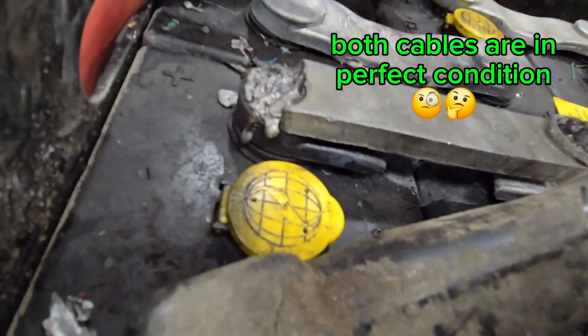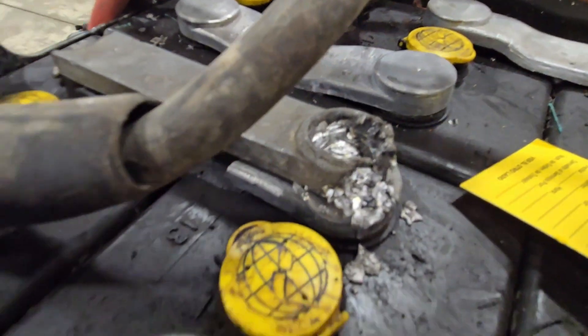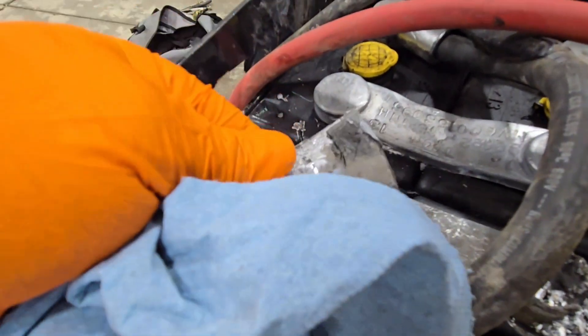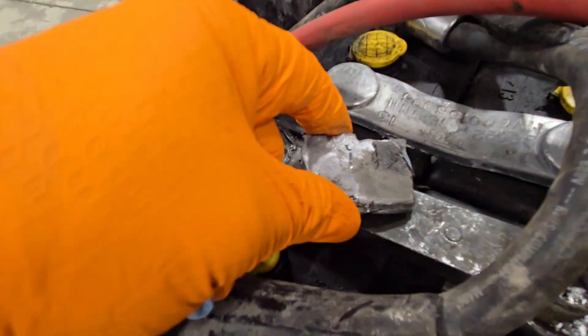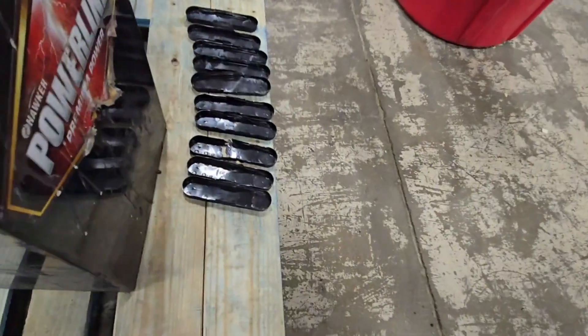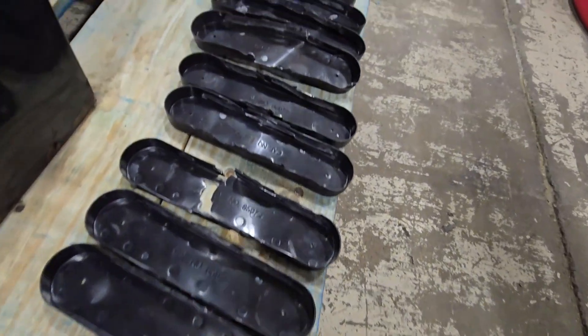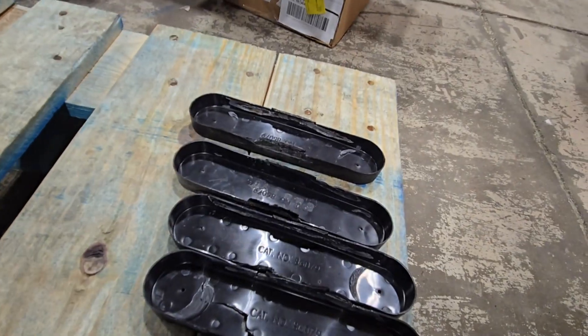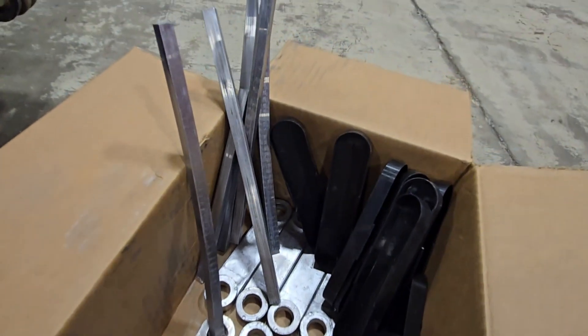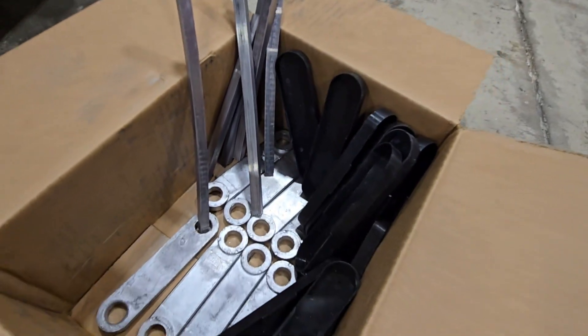Just for testing purposes, I wanted to make sure the battery was still usable, so I crudely welded one back in. I've always saved various lengths of intercell connectors, not knowing why, but that kind of paid off here. And these are all the caps — I had to basically peel them off of every one, and they were just freaking melted.